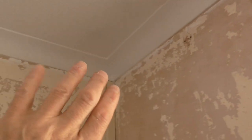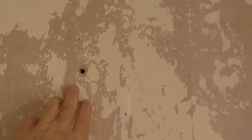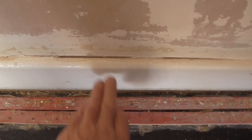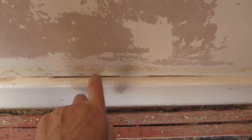The coving all needs sanding down, and the walls all need sanding down before you start doing any filling of all the holes. Skirtings need sanding, door casing, just bits up this side. Little bit of foam and then polyfiller over the top. Any parts around the skirting board which are slightly loose and I've got cracks - little bit of foam, polyfiller.